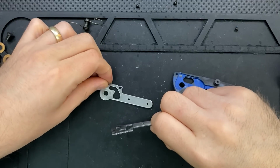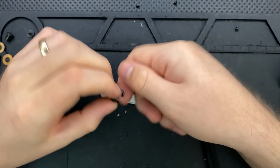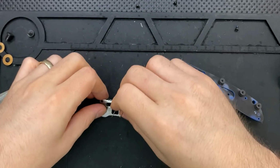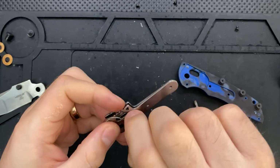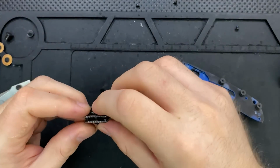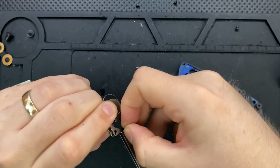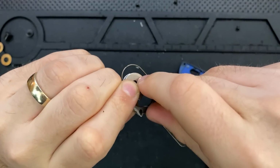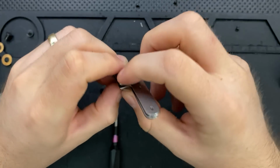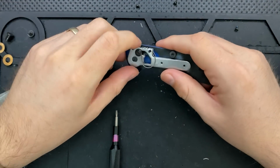Okay, next thing, put the stop pin in place there. Now what I need to do is get this threaded back through there. And so what I'll do is I'll kind of hook this side of the liner with the Omega spring. And now I slide this whole thing up into here. Great. Now at this point, what we can do is seat the first Omega spring. So by seat, I mean that I want this little spring here to go into this little hole area. Nice beefy Omega springs, by the way. And same thing over here. Beautiful. Now we have this whole package ready to reinstall, basically.